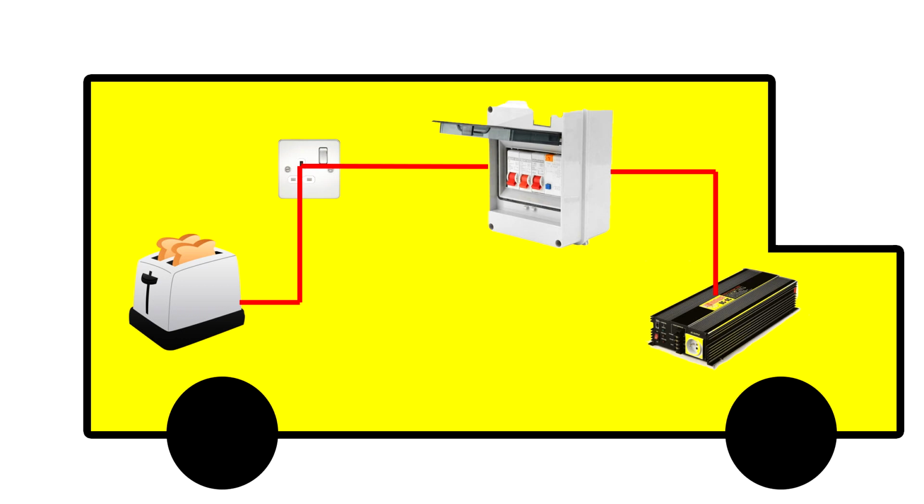And then by the time it got back to your inverter, it would be converting it back into DC, so you'd like to think there would be an earth separation in that, so that everything on the flip side of that would be 12 volt DC, and none of your earths to your vehicle would then go live.